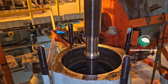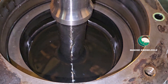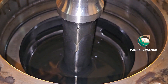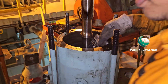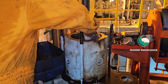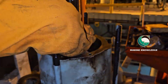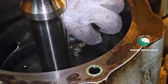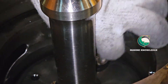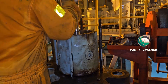The reason I remove the actuator piston first is to avoid any lube oil spill while lifting the air cylinder housing. Inside there will be a lot of lube oil, and when you lift the complete cylinder housing unit there may be chances of lube oil spilling if the air cylinder sealing is not completely okay or if any damage is present. Now we are cleaning, and once cleaned, fit the eye bolt and lift with the help of a crane since it is not so heavy.